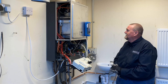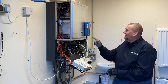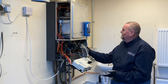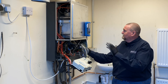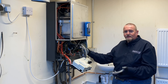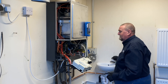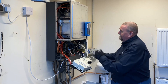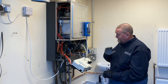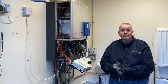I'm going back on to high - with the dust cap on we're there at 10.3, happy days. On the low, waiting for it to modulate down, we're there at about 2.3 - that's fine. Pop the little tag back on, turn the tap off, remove the analyzer, and check the test point. I'm going to put the boiler back together and then go through the front display lights with you, telling you what they do and how to identify any issues.